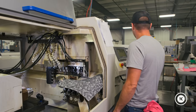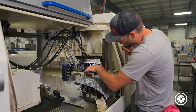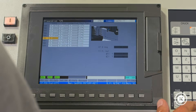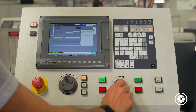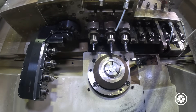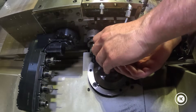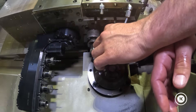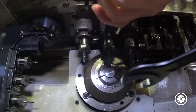Now we're going to call up that tool position — in this case we're in tool position eight. Go to the preparation page, make sure the raw material is back out of the way, and get the position point of the correct tool. Go to tool eight, go to position point, and take your time — you don't want to smack anything. Turn the feed rate down, then hit cycle start twice and control it by jogging the feed rate. You can see with the material back I actually have to lift the tool up a little more based on where the core position is. I'll do that, get it close, grab the wrenches, and give it a good snug.